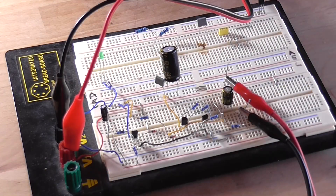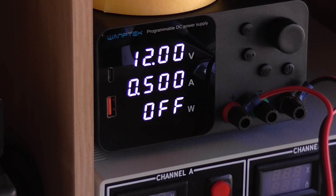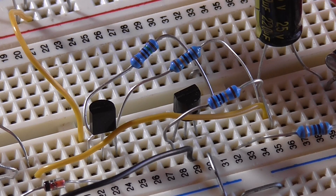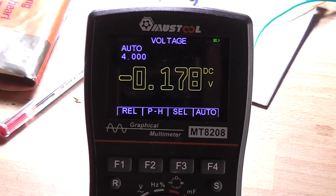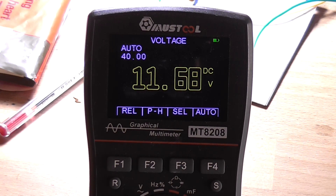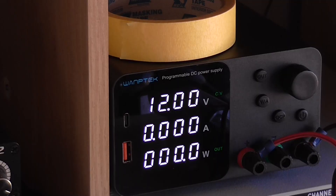A short time later, I've got the circuit built and I'm ready to test it. I have a multimeter set to the DC voltage scale connected across the output to measure the actual DC output. The power supply is set to 12 volts at 500mA current limit, and I've included two 10 ohm resistors in the emitter circuits as degeneration, because the transistors did go into thermal runaway very easily at 12 volts. Turning the power on, we've got about 11 millivolts — less than 1 milliamp through the speaker. As the circuit warmed up and stabilized, that voltage dropped off considerably to nearly half, and the current draw is only about a milliamp unloaded.